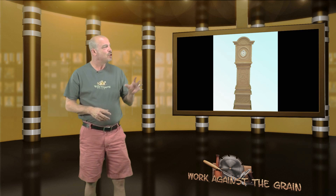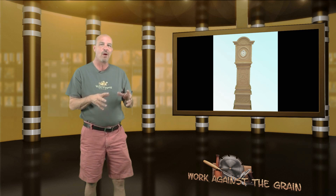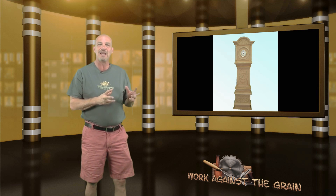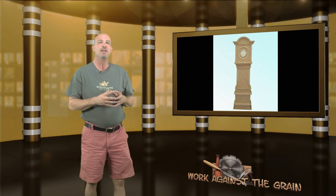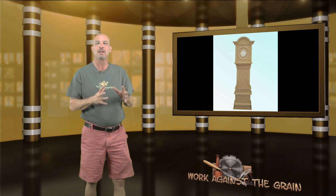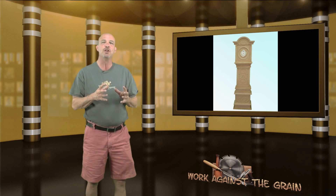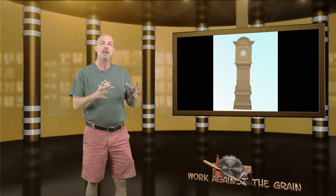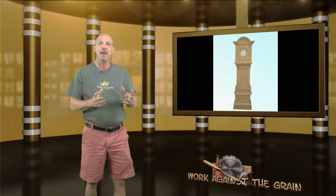And when it's all said and done, this is what we end up with — a 42-inch mini grandfather clock. I chose to make mine out of MDF as a prototype, to make sure the tool paths were right for my machine, that the speeds and feeds were correct, and that the look was correct. On the top molding, I didn't cut the miter perfectly the first time, so I was glad I used MDF as a prototype. He also suggests using screws or nails — I have a pin nailer, so in areas where needed I used that in addition to glue, which sped up the process and the nail holes don't show up at all.